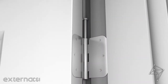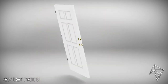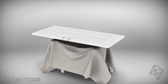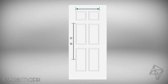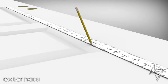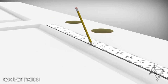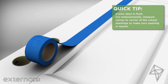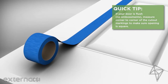Remove the door from the hinges and carefully lay it across your sawhorses. Position sawhorses with a drop cloth draped over them to catch all debris and protect your door from scratches. Measure the embossments on the door for both width and height. Use your pencil and straight edge to indicate the cutting area on the inside of the door. Apply blue painter's tape along the outside edges of your cutout area.